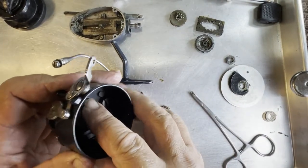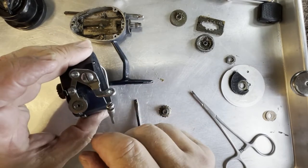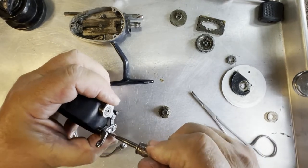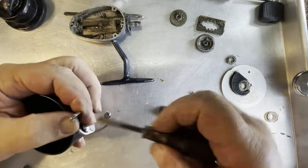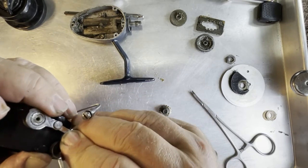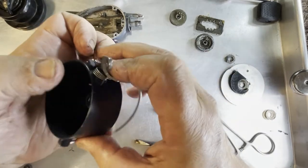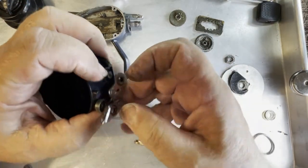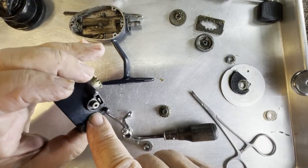With the lever inside, you can push it over and it will trip it, flip it over. Now that we know how that part works, let's take the bail itself off — the spring portion of this off — and this promises to not be fun. That's got that screw out. This is going to rotate around — it drops down there. At that point, all of this should lift out. That lifts out, and all of it comes off. And now you can see all the dirt caked up down inside of here, and you see the teeth inside there that are going to mesh.